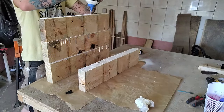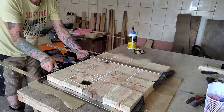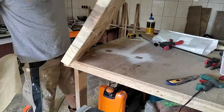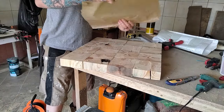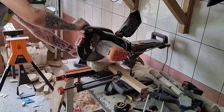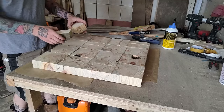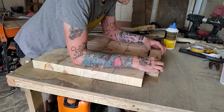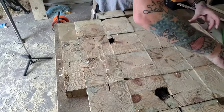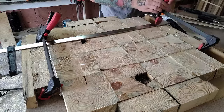Here's another twist in the story. Just when it seems all is going to plan, life throws me another curveball. Turns out, this mega square won't quite stretch out to the 60 centimetres diameter I am aiming for. There are unexpected hurdles in every project, but I love these little challenges. It's time to slice some more wood — I cut four more squares from the scrap wood, slice them in half and glue them up, extending the edges just enough so that I can cut out my 60 centimetre clock face. And with that, I'm back on track.